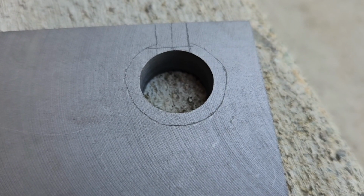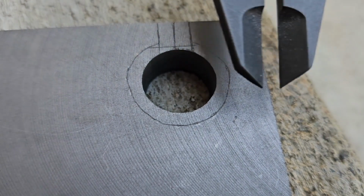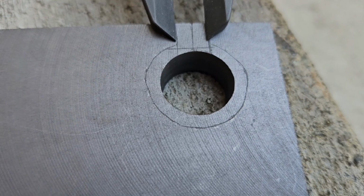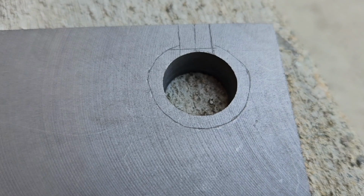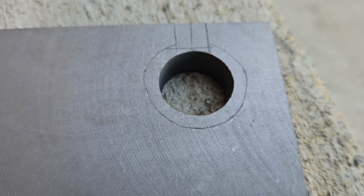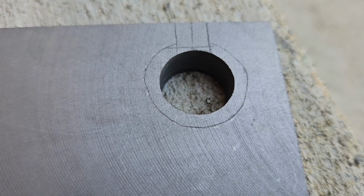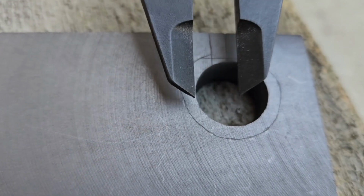So I went through and marked up the dimensions that I'm going to want to cut this thing out for. I set this for 3.5 millimeters wide and gave myself about 8 millimeters of room for what will eventually turn out to be the setting. Of course, both these are wildly more than I'm actually going to need for the ring, but graphite is reasonably easy to sand down or carve down, so it's good to leave yourself with a little bit of extra room.